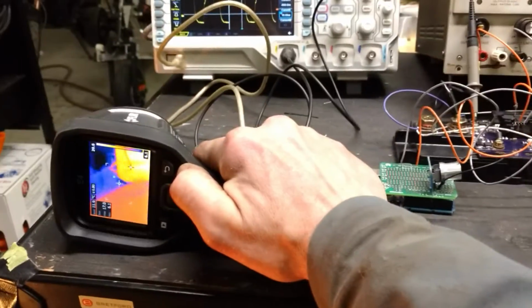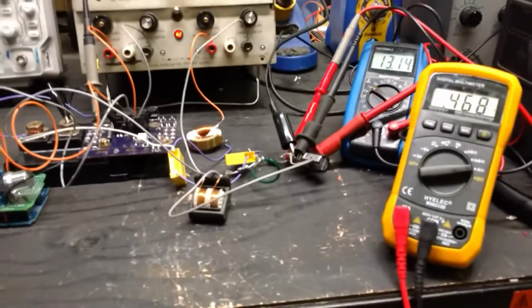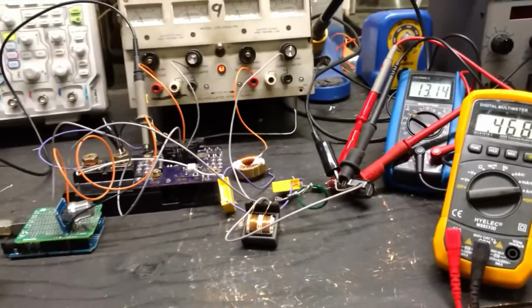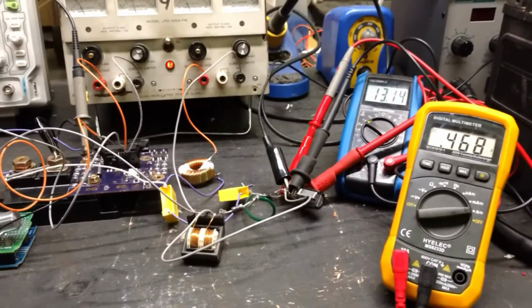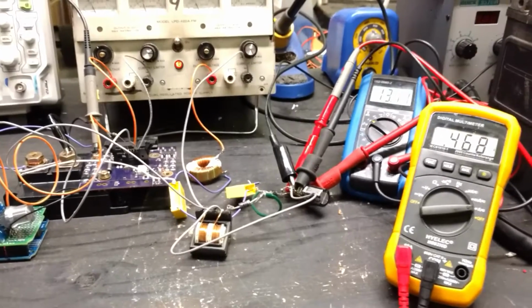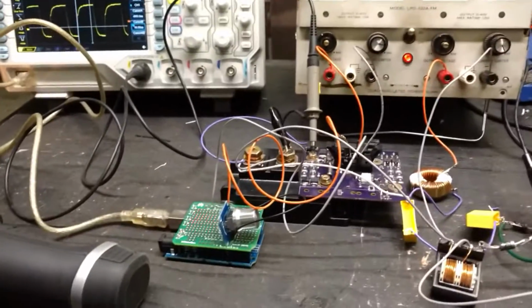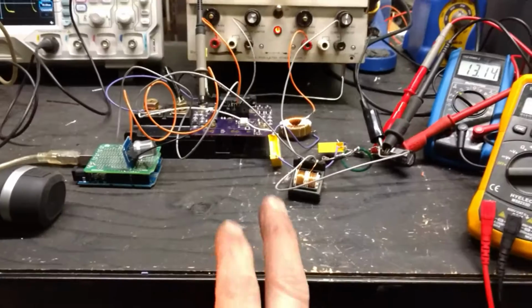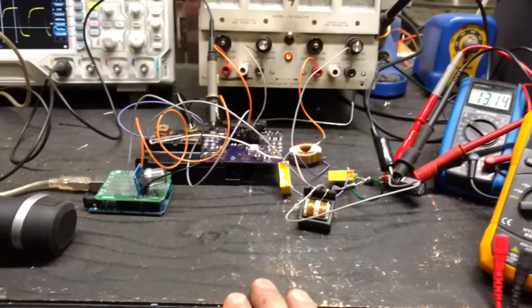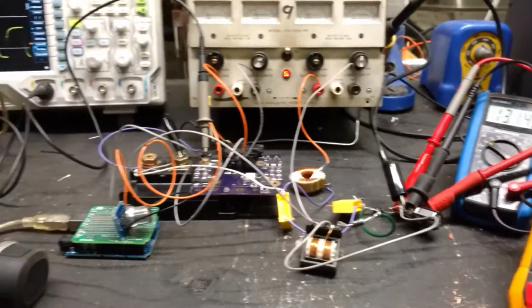When your battery climbs up to, I'm going to charge at about 230 volts per side, roughly 233 or something, and that'll give me, with 112 cells, around 4.17 volts per cell, something like that. What I need to do is probably build one charger to charge the whole thing, or two chargers to charge separately. I'm kind of contemplating doing one charger that pumps out 460 volts at max. I got to do some experimenting to see how efficient this will all be.